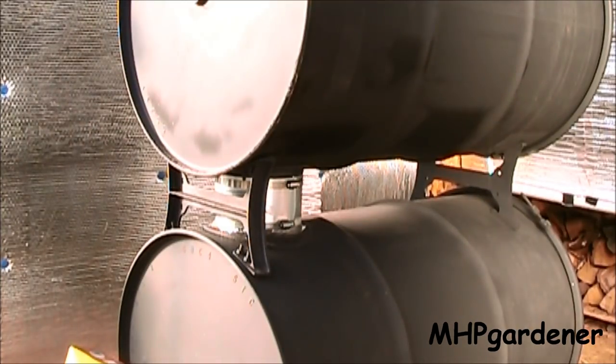If you want to do a double barrel, you need the double barrel adapter kit, which allows you to stack two barrels one on top of the other. Basically it's a secondary heat exchanger that allows you to extract even more heat from the wood as opposed to letting it all go up the chimney stack. You can see how they stack up nice and neat using the legs that come with the adapter kit. You also get two six-inch collars, one for each barrel, to make the junction between the two. What you don't get is a piece of pipe to go between the two collars — you have to make that yourself. I cut down a piece of extra pipe, put it on the inside, taped it up, then put a piece of heavy galvanized flashing and a couple of six-inch clamps on the outside to get it pretty much airtight.